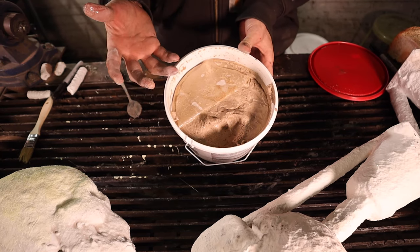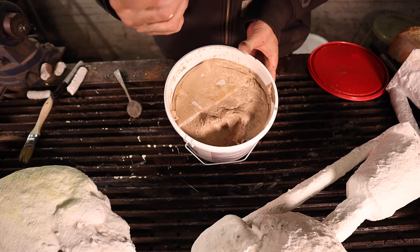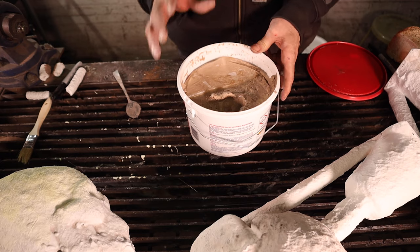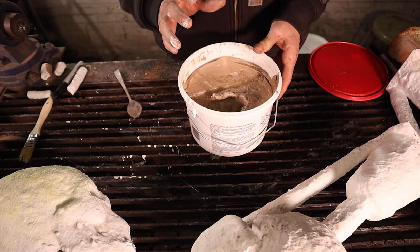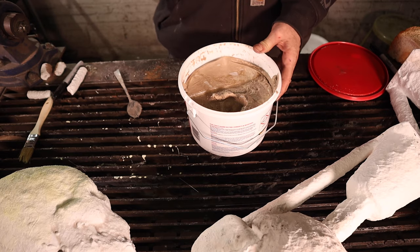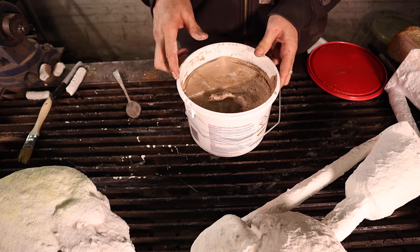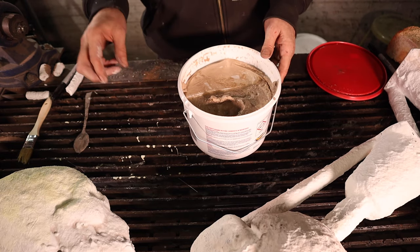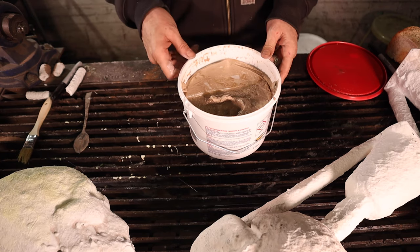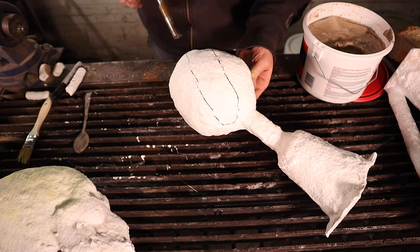Not only does it have its refractories, but my understanding is it also contains a certain amount of resins, plastics, and fiberglass in it, so it can be a tenacious material. The trick with this, though, is you can apply it similarly to the Green Patch — heating the shell initially. You do want to refrain, for the same reason, from trying to set your patch with a torch, because you can seal off the outer surface, trapping moisture that could later pop your patch from the ceramic shell as you get into the preheat. We're going to go ahead and preheat the surface just a little bit.